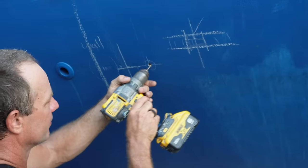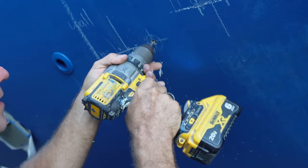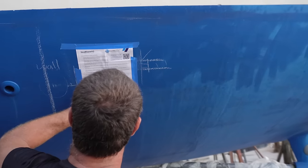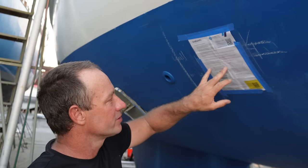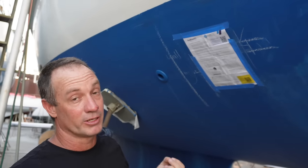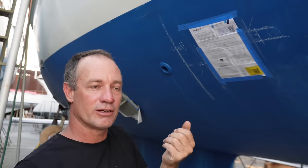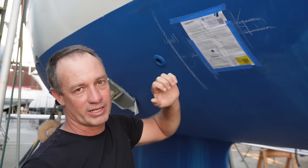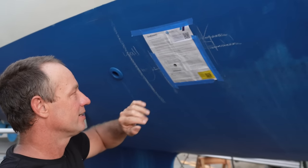So what I'm going to do is stick my favorite tool in here. I'm going to oversize these three holes. They're very specific with their drill dimensions here because they're bronze screws that they supply — they tend to snap pretty easily, so they want you to get your hole pretty right. For us, I'm oversizing, filling with epoxy, and I'll re-drill after and just test it. It depends on your hole integrity, whether you've got solid glass, a timber boat, aluminium, whatever you've got. It's a matter of trying the fastener in first and not putting too much pressure on these bronze screws because they'll just snap on you. I'm just marking this out now, and then we're going to fill this with epoxy.